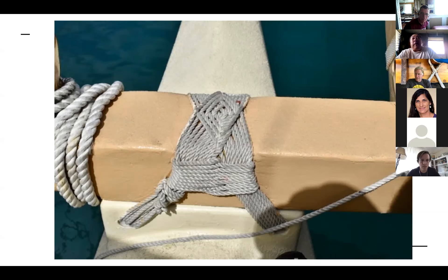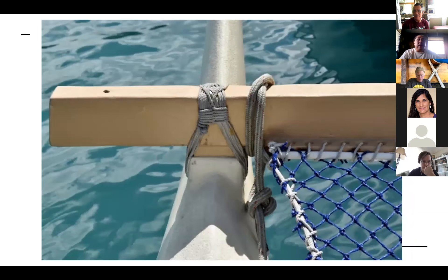As to the length — the spreaders we were doing on Hiki were like 11 arm spans; in some cases it's six, just depending on the distance. What I try to do is, if I can save the line when we remove it, I start taking measurements of what was on there and add on about another half arm span, since we know we've cut some off. Otherwise, I don't have it committed to memory. I can estimate: if it's maybe 18 inches over or 36 after one full wrap, and I need to do nine, that's nine times 36 — but I still add extra just to be safe. I'd rather cut long and waste a little than have a short line and not have enough wraps.